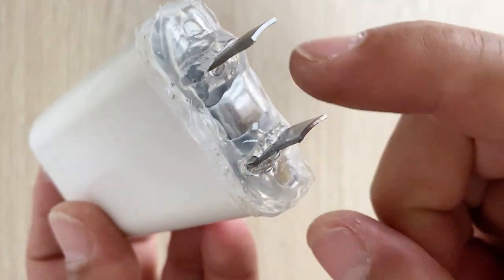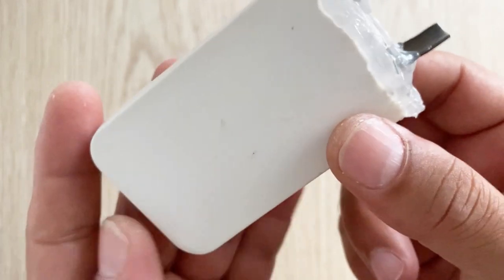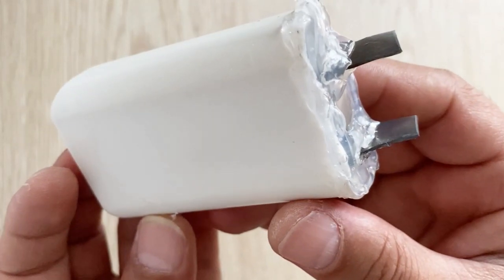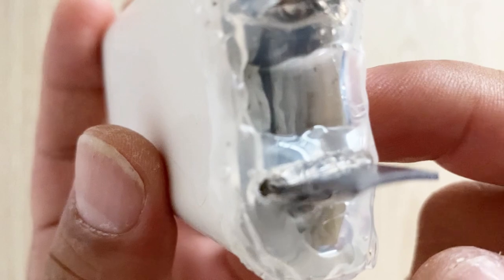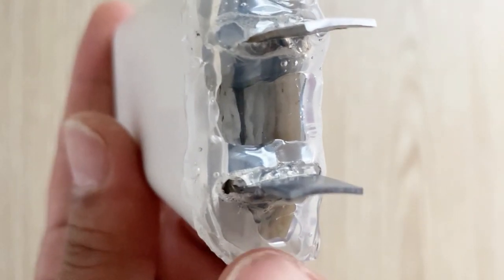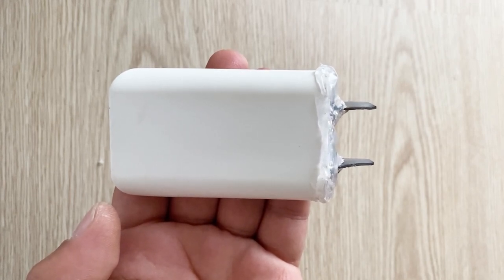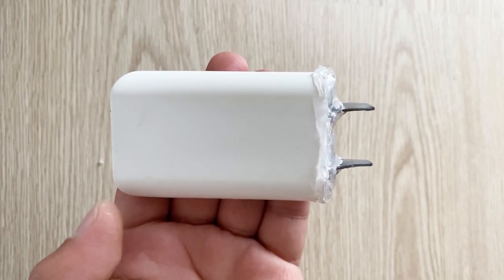I've covered my battery with a small piece of plastic, sealed it with hot glue, and cut the excessive part of the lead connections. As you can see, I have a very nice lead acid battery — 2.1 volt. I left a very tiny hole here: the purpose is so when your electrolyte diminishes you can add more from here, and also for safety to prevent any possible explosion from overcharging. I recommend leaving a tiny hole like this. I hope you enjoyed the video — please subscribe and like. Take care of yourselves, see you in the next videos.